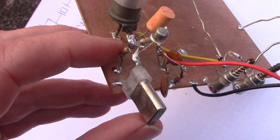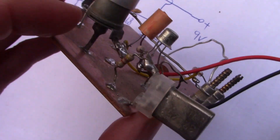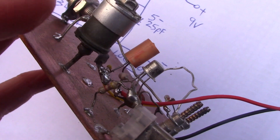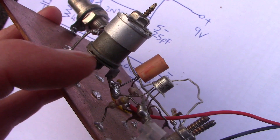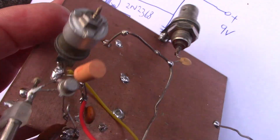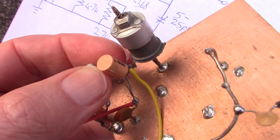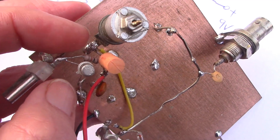Right here is the crystal oscillator. You can just see the crystal there — 37 MHz. Using an old style of transistor, a 2N2368, although a 2N2222 should be okay, or even a 2N3904. We're only talking about 37 MHz here. This is a variable capacitor, a trimmer, goes up to 25 pF. And this is an inductor of 1µH. That resonates to 37 MHz.